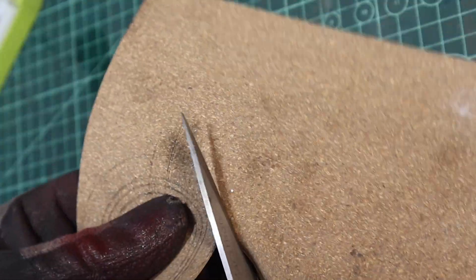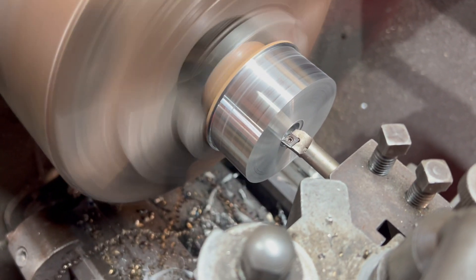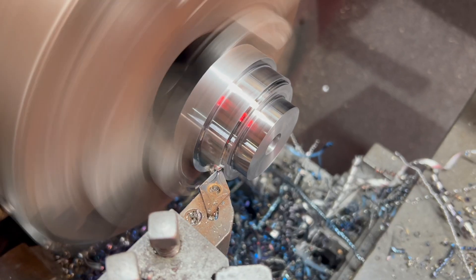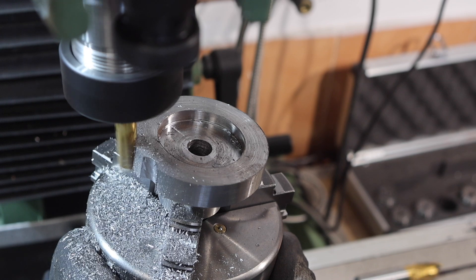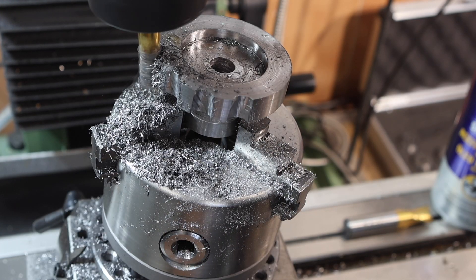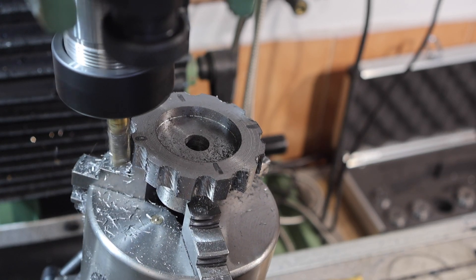I'm just making a cork gasket which goes underneath the main nut. I'm also making the part that goes on top of the jack which will touch the chassis of the vehicle. I'm now cutting a pattern into the edge of this piece using a milling machine and a dividing head — I'll need to use it slightly off vertical and then again horizontal, a little bit lighter.